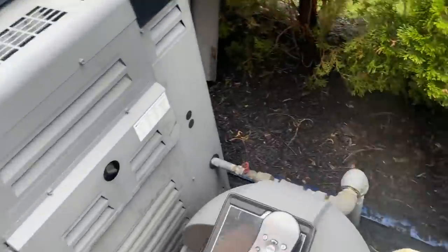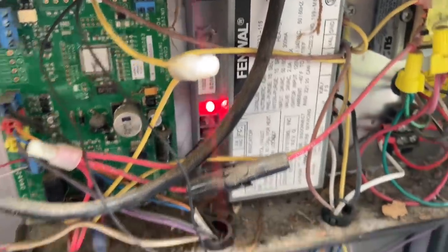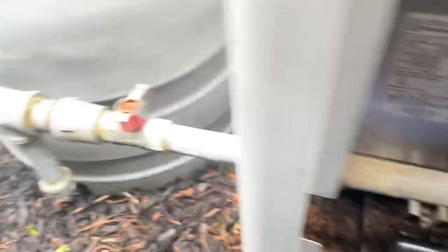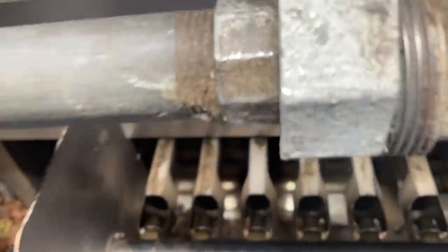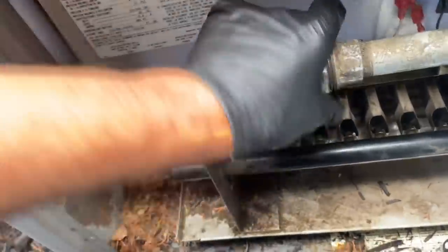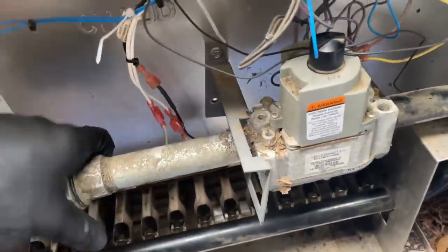First I want to crack open this unit and get my tools. Let's see if we have any gas here. It's giving an error for no flame detection. One of the first things I'm going to check is whether I have gas. I could test for gas pressure, but if I crack the union open — let's make sure we have gas first. I've got gas there. We're good. Put this back together and leak test it with an electronic detector. Now we're going to check out the gas valve.